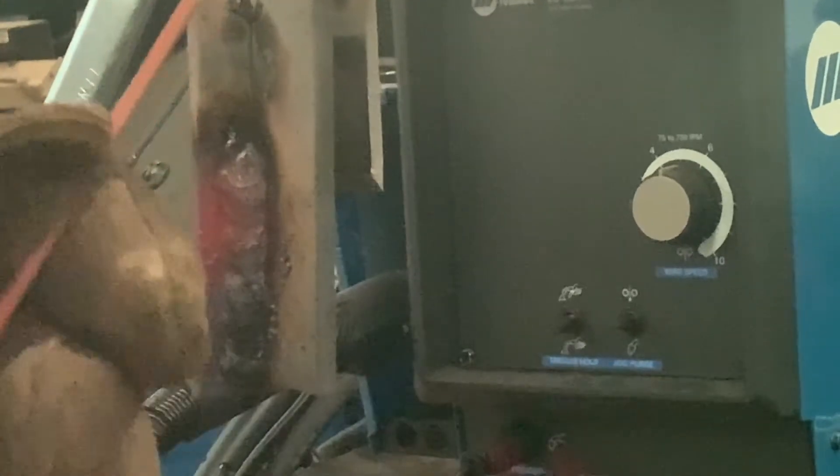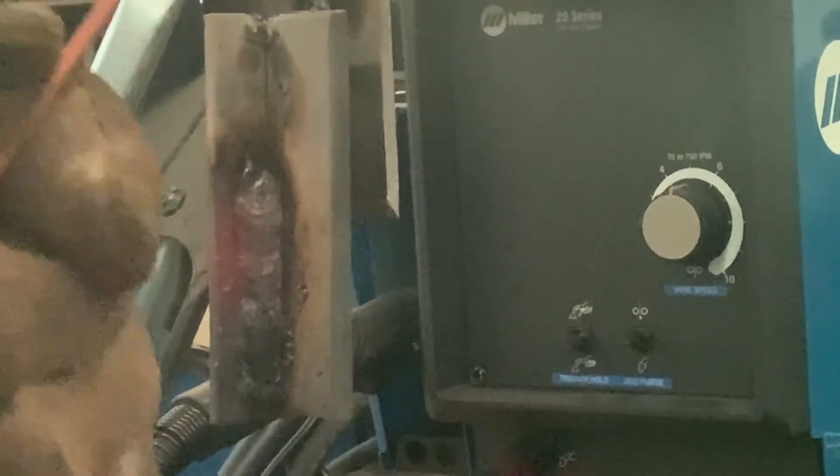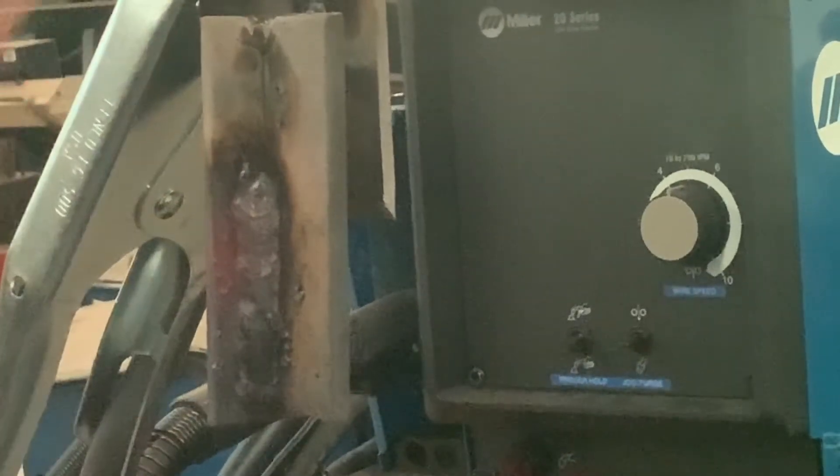When we start the restart, we're just going to kind of drop down. We're going to strike down in our weld path — we don't want to strike out here on the sides. Strike down into the weld path, do that side-side motion. And then when we finish it off, we'll cap it. Kind of watch it just fall right in there every whip — the puddle just falls right in. If you're going to get a little gouging towards the top, be careful you don't blow the top out. Going right into our cap. There's our cap.